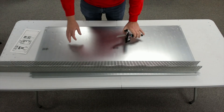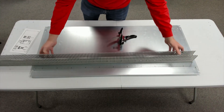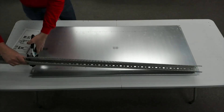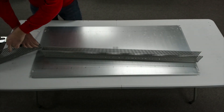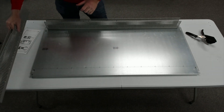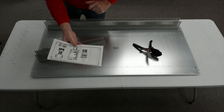I'm going to start by cutting the overall piece of wire duct that'll run all the way down this panel. Be really careful when you're doing it because you have these mounting holes here and you don't want to end up over top of those, so give a little bit on either side. I'm going to take my wire duct cutters — we have videos on various wire duct cutters and you'll find that link in the description. Then I'm going to butt that up on the side of the panel, and that's going to tell me my length. According to my drawing, I need five of the same length.